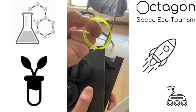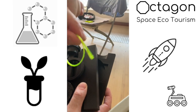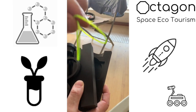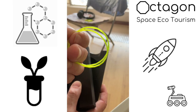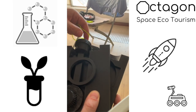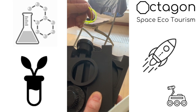Like everything else, basically they're too big. So I'm going to have to put the TPU back into the 3D printer and go on a rampage of printing various versions, shrinking the diameter of these things and increasing the extrusion, so that I get a more consistent one that will fit in here and provide the right tolerance with the actual wall.